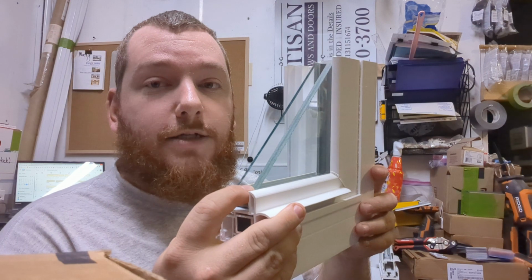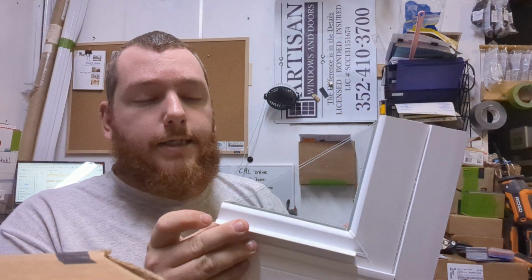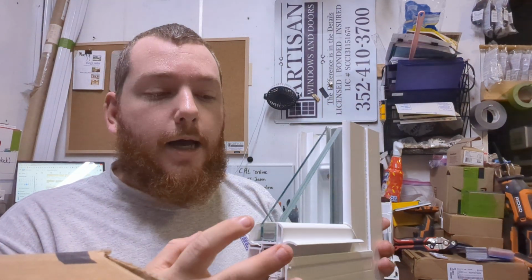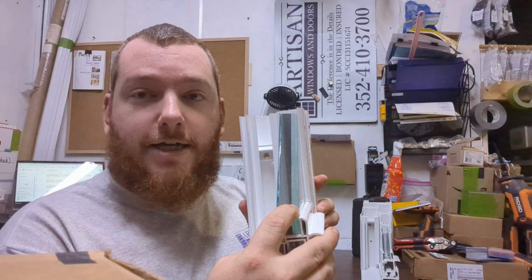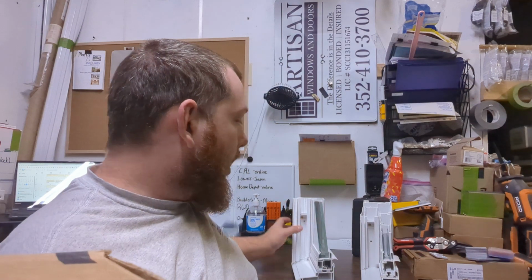So this laminated glass is very, very hard to break. It's very strong, and if it does break, it does the same thing as the windshield of a car. The windshield of a car is laminated as well. If it's hit with like flying debris from a hurricane, for example, it'll break, but this laminate membrane is flexible, and it'll hold the glass together. And you can bend it out of the way, but it holds together, and it's going to keep wind and rain from a hurricane out.